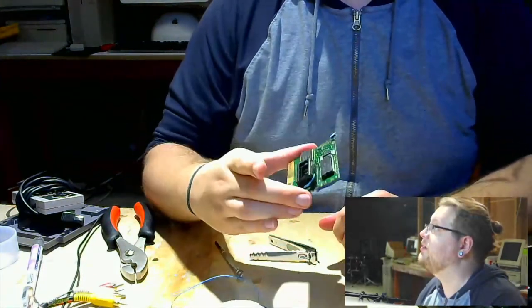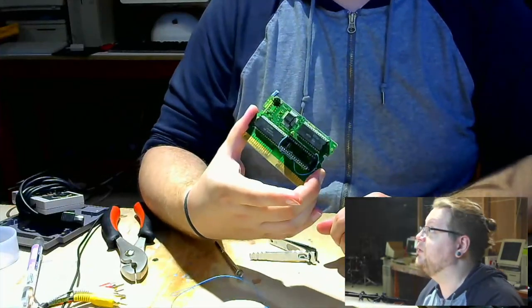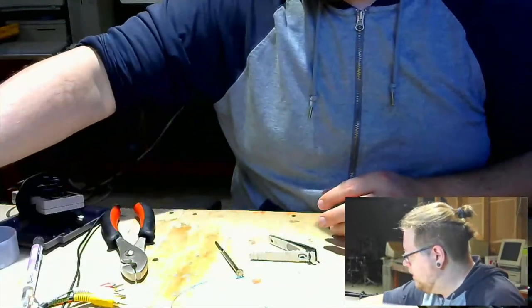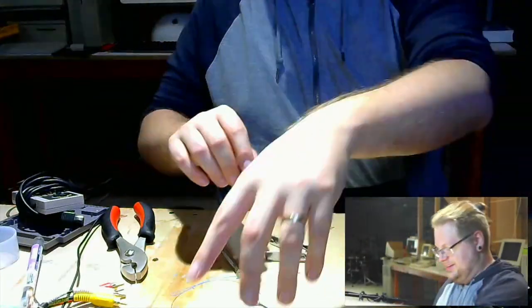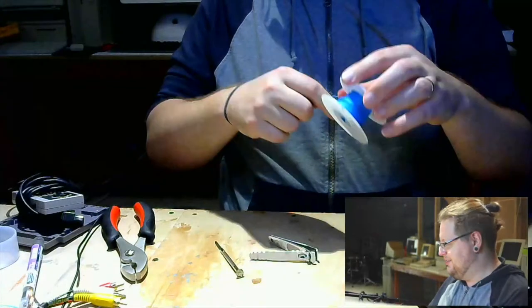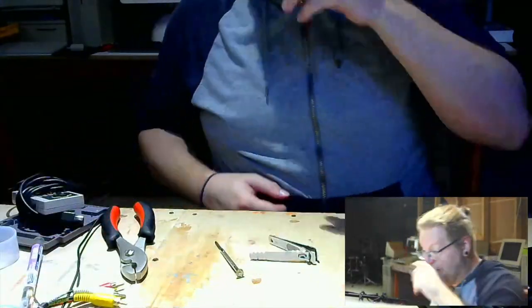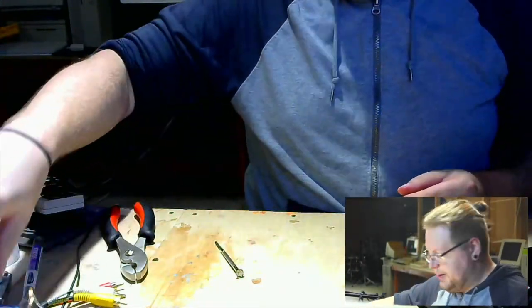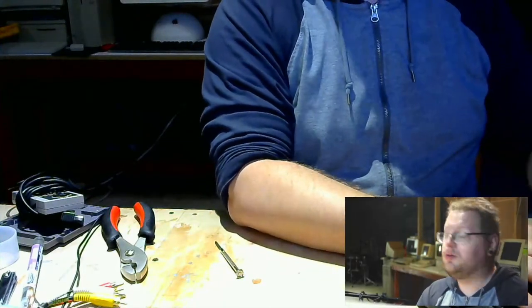Okay, so theoretically, hopefully, I can just plug an EEPROM into that and it will show up in various places in the NES's memory. And of course, the fun thing is going to be I have to line up that cart just right and get it plugged in just right, or it won't boot at all, because I didn't really show that on stream, but you have to do it with the actual Mario Mask ROM in there too, just because the edge connector is kind of shit. So I think it's programming now. I think we do a program.